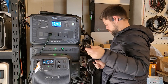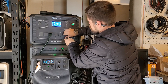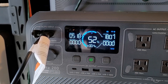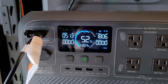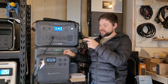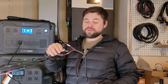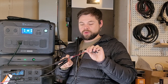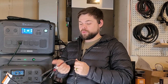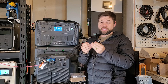I also want to see if I can wall charge this while solar charging, because that would be super fast charging into this 2,000 watt-hour battery. I'm going to use my AC300 right here, plug it in, and — would you look at that — we're getting 500 watts from solar and 1,800 watts from wall charging. One of my favorite things about the Elite 200 V2 is being able to get 20 amps of input on just one of the solar inputs. However, the cable feels really warm right now — I would not recommend doing this long term. You definitely want to split the input so you're not exceeding more than 10 amps on each cable; they're just too thin.